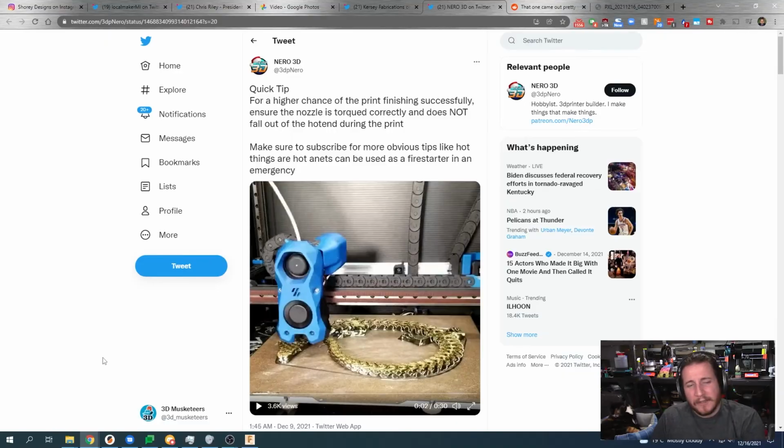I'd love to compare them to some of the other hot ends on the market for fit, finish, design, and functionality, and probably use the Wham Bam Mutant as the platform to take everything on and off. It's probably just going to be a whole lot easier to do it that way. But yeah, this one's a bummer. There's really no good way to stop this from occurring other than checking your nozzles, but realistically, if it's properly torqued from the factory or properly torqued from the beginning, you shouldn't necessarily have this problem.